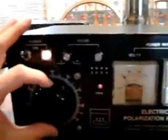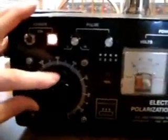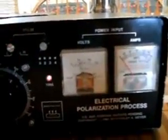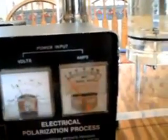The first thing we'll do is take and turn this thing up to about 50 volts. You can see the voltmeter fluctuating with the pulses. There's barely some movement on the amp gauge. As we come up to the cell, it is just now producing a light stream of gas. We can adjust the cell at the top to close the plates to increase the gas production even farther. As the plates come together, the gas rate increases.